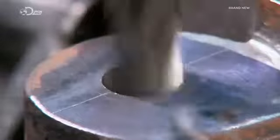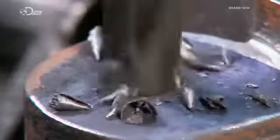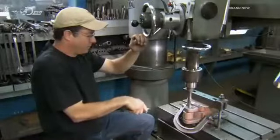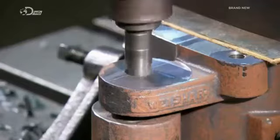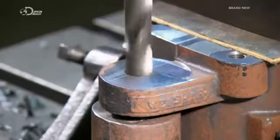Iron is the ideal material for glass moulds because it can hold molten glass at a temperature of over 1,000 degrees Celsius. Iron expands under such heat. However, once it cools, it contracts and resumes its original shape without any distortion.